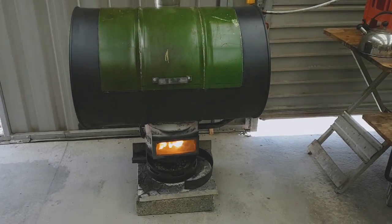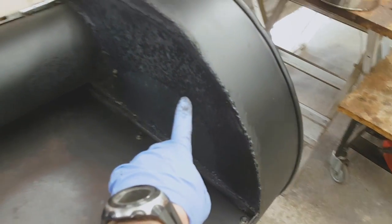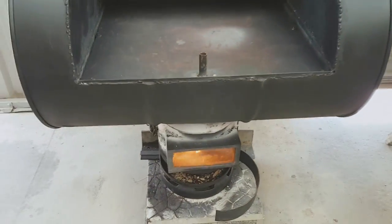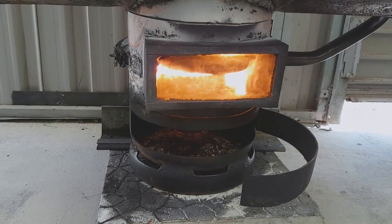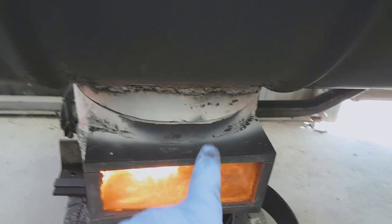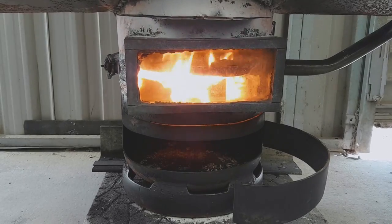So that's the setup. There is no smoke outside. There's my 6-inch pipe going from side to side. The hot flue gas is going to these cheek parts and then has to travel sideways and up — that's by design. These panels get hot in the order of about 200-odd degrees. The welding is more than a bit rough, but it's holding together. That's why I put the brake disc in there — it forces the flames around it and helps with the burn. The air for combustion is leaking in through the top and bottom of the door, but it gets plenty of air through the burn chamber and it's running really, really well.